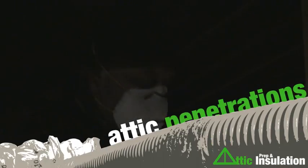We're by the chimney to check for moisture or warm air getting up into the attic. Let's depressurize the house to 50 pascals. We set up the blower door downstairs to depressurize the house. If there are any leaks around this chimney, I use a smoke pencil — the smoke should get sucked down through the chase way and then through the house.